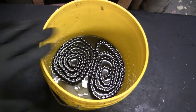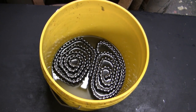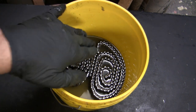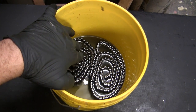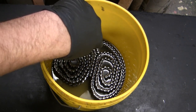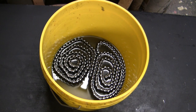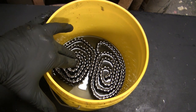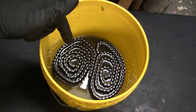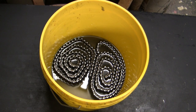However, one aspect of the tracks that does make them problematic to enhance further is the surface material. You see, the tracks, like I may have mentioned before, and I have also mentioned in other videos, have a thin film of oil that is found on all of the external and internal surfaces of the track. This is done for a multitude of reasons. It keeps the tracks nice and fresh from the factory. It also helps with the lubrication of the links, making sure they break in evenly. And more than likely it probably helps with manufacture, the way they have them jigged up, and I wouldn't be surprised if they have a pin inserting machine, and the oil helps during that process.